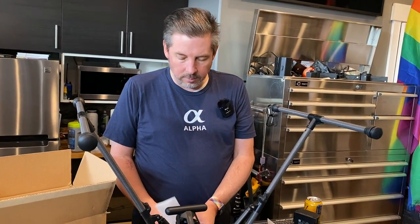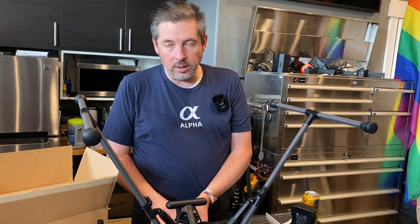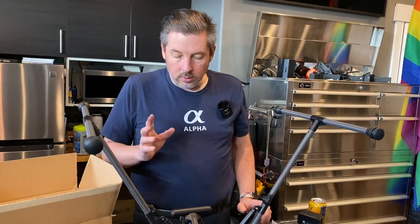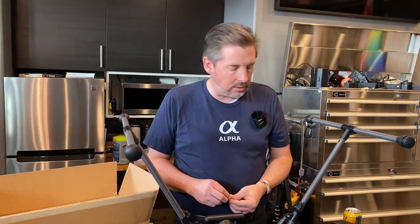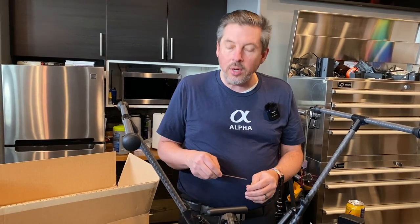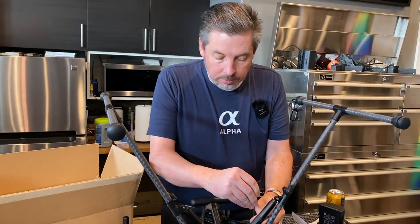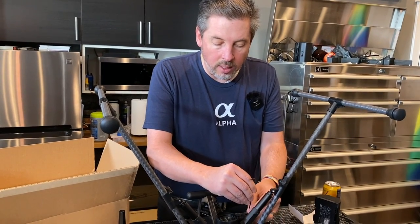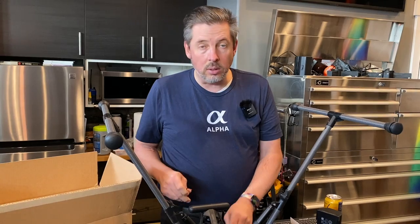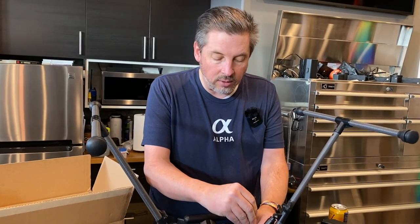Japan is a different place as far as some of these things go, and I don't know if the frustrations the guys in Japan have transfer directly over to what we're going to be experiencing in the United States. For example, over there they have the CE mark, and in Europe they do as well, and they cannot have as much power on their transmitters as the FCC allows in the United States. What I don't know is whether this transmitter has different guts and works any differently than the one they're using in Japan. I have no idea. I will know soon. I suspect that it's different, but I'm wondering if it's a software or a hardware difference, because there they don't have 5.8 gigahertz. That's used for cell phones. The allocation of the bandwidth is different. They have to use everything on 2.4.